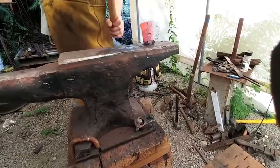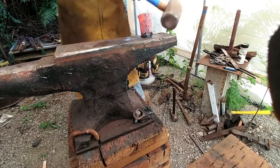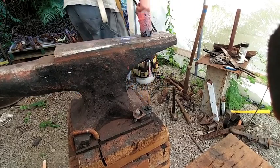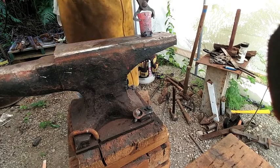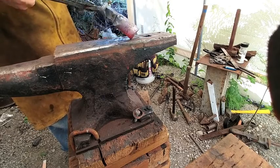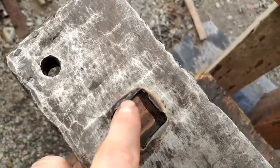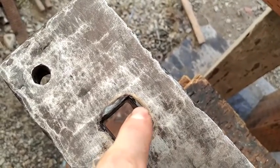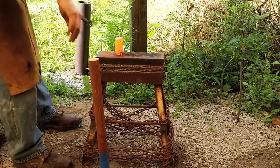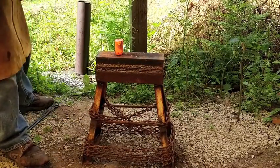It's only a 100-pound anvil and it's not anchored to the ground. There we go, tapping it out and back into the forge. Unfortunately that actually tempered my hardy hole — you can see the tempering colors there. I didn't expect that much heat to be produced from that. Don't want to worry about that — in this striking anvil it's just mild steel. The camera is four feet away but still you can see how much the hammer moves it.